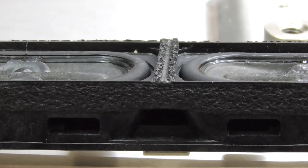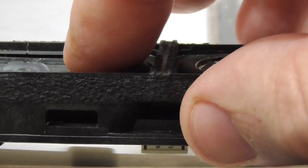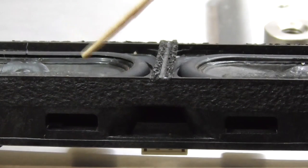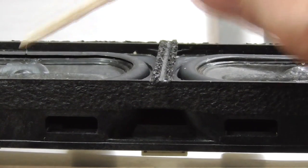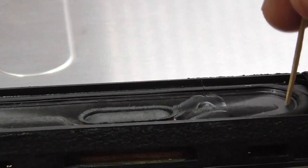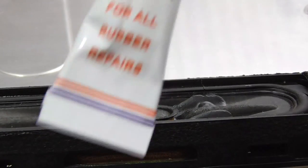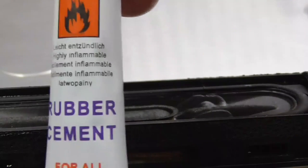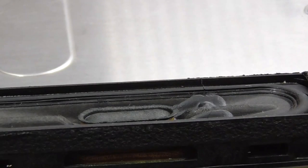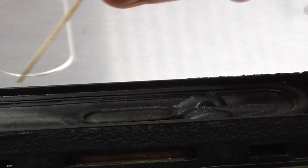Here's another problem I found with this TV - the speakers. See, the rubber surround is separated. Push down here, you can see there's a gap between the surround. Most of the speakers are like that. What I'm going to use is this rubber cement from a bicycle puncture repair kit. In theory this is much better than silicone and all that kind of stuff. I've already done the other side.